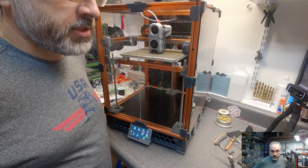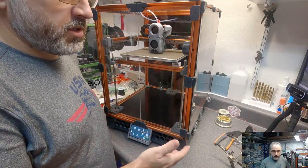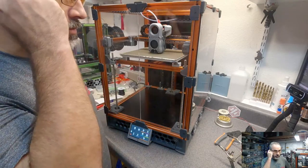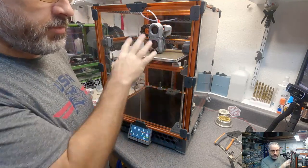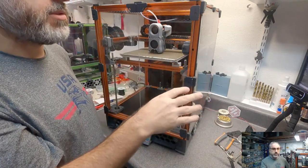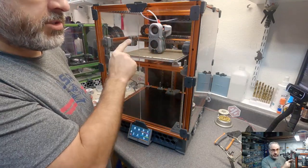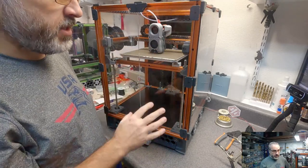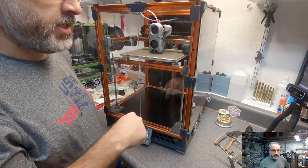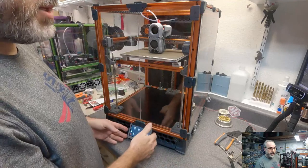Any parts one should buy if one would like to start right away, if something would be released? The changes that I'm working on for 2.4R2 are almost entirely in STL changes. The only thing would be moving the MGN12 gantry over to officially in the CAD and release files for 2.4. So all that stuff is there. You just go to the Trident repo for it. Other than that, there aren't any parts really that are needed. It's maybe a couple of fasteners because the display changed, but it's the display that comes from Trident.